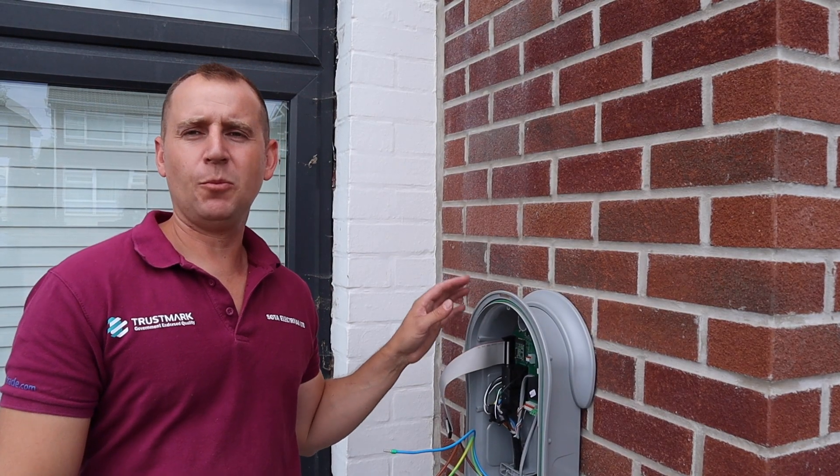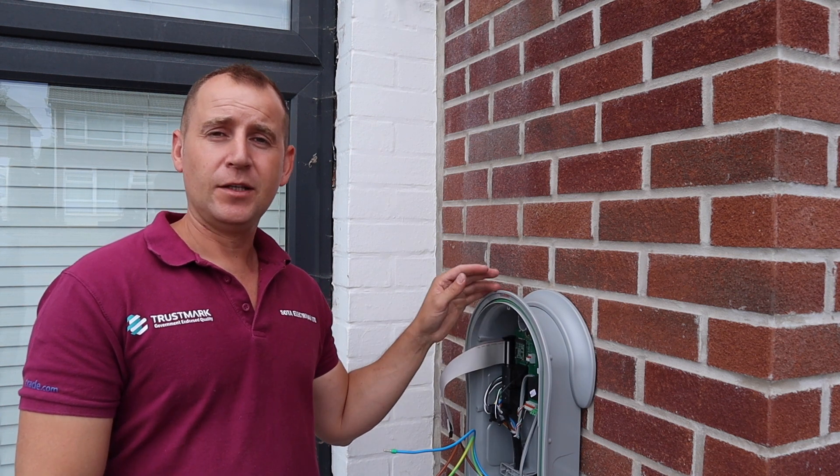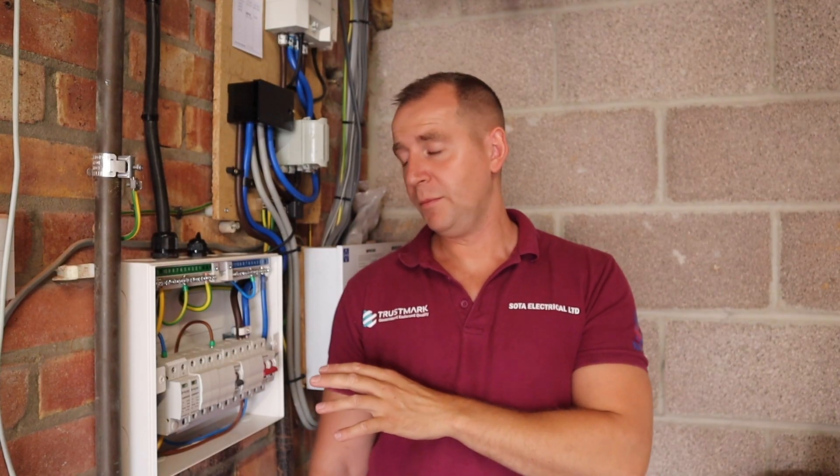So I'm here at the Zappi end. I'm just doing my R1, R2s and then I'm going to mega through the cable and make sure that's all safe, and I'm going to terminate it both ends and do some live testing. That's this end all terminated. I'm now going to go to the other end and do my live testing and I can come back, put my cover on, put the stickers on and it's all buttoned up.